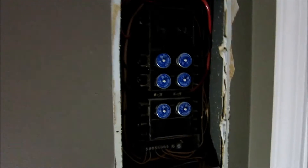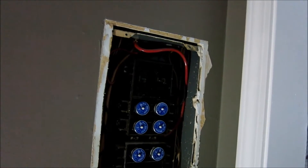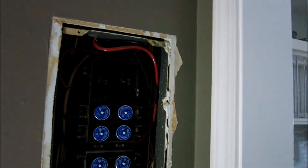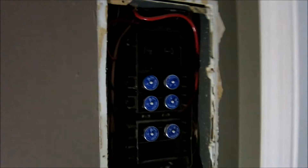What some people do is they'll take the hot wire, undo it, tape it up, and then work on the panel. I don't suggest doing this because if that hot wire comes off you've got a whole lot of problems. If you have a smart meter and you blow it up, BC Hydro will probably charge you a hell of a lot more. So again, don't do it.